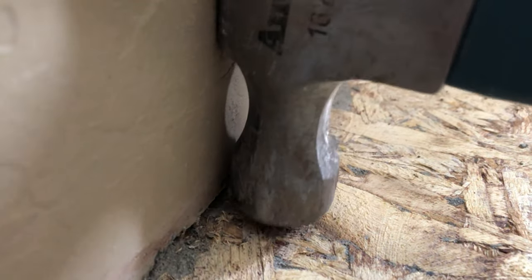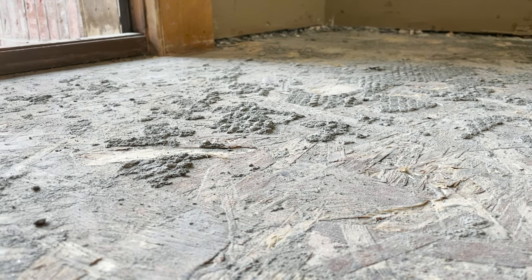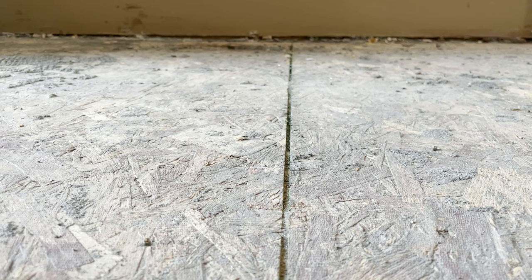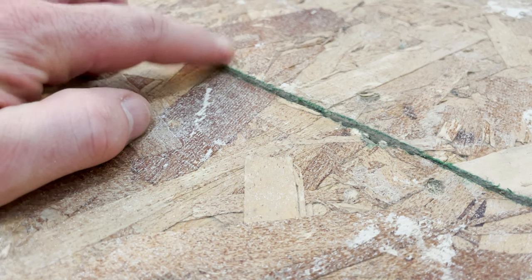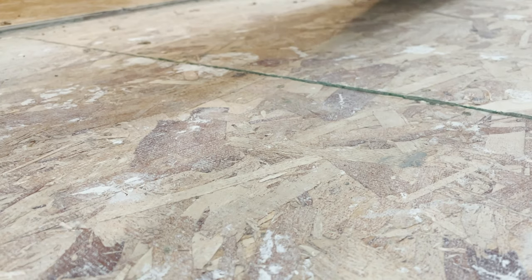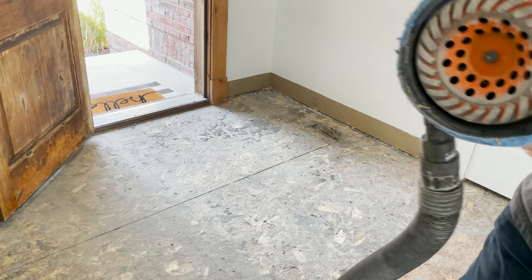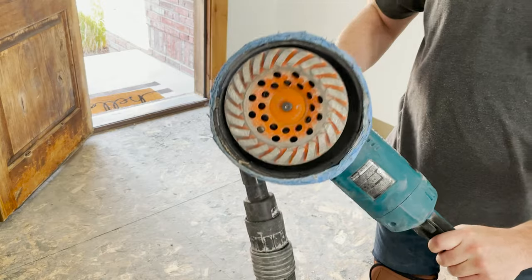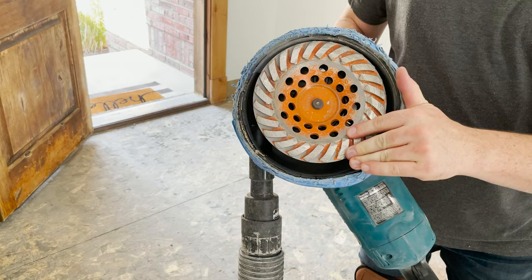It's really important to get all the pieces and make sure it's as clean and level as possible. I also had to pound down several nails that were poking out in the floorboards. Now that the baseboards are off, it's time to remove any leftover cement on the floor. I need the floor to be as level as possible. I also need to level out the joints in the floorboards so that they're completely smooth — otherwise there's going to be a bounce in the floor. To remove the grout and excess cement, you'll need one of these grinder beasts as well as a diamond grinding wheel. I'll also hook it to a vacuum because it gets very dusty.